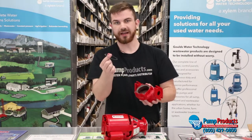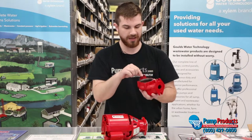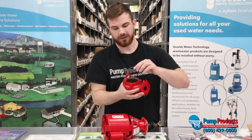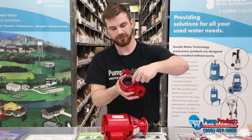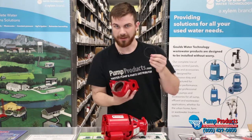You're going to want to remove the casing gasket. Depending on how long this pump's been in operation, you may have to take a small screwdriver and just carefully work your way around the edge to remove it. This is a brand new one, so it came out with no issues.